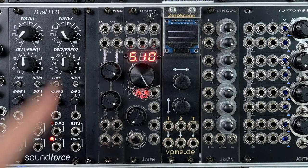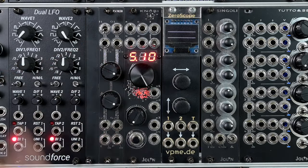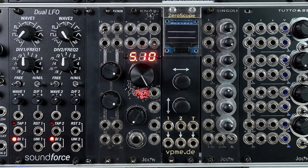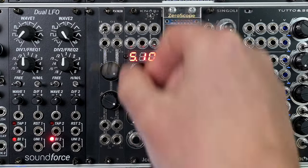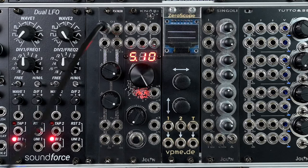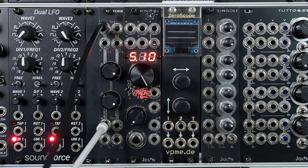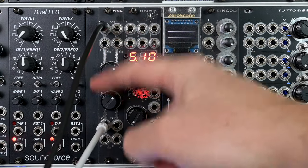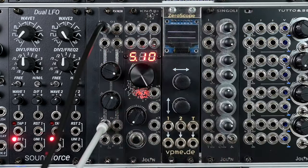You can use these two parts completely independently if you connect two separate signals here. Then I mean really just connecting a mono jack cable into the first input and connecting something else to the second input. If you then tap a signal out of the outputs, you'll be able to amplify them separately and use them separately for whatever you want.